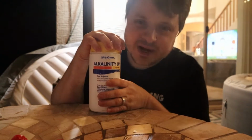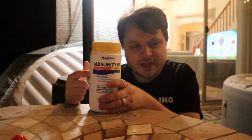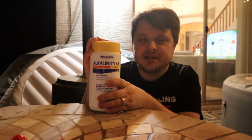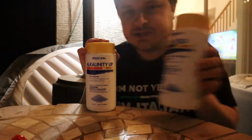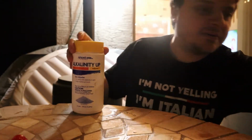pH Up will raise the pH in your water much faster than Alkalinity Up will. So if you need a quick adjustment, you should use some pH Up. pH Up will also raise the alkalinity in your water, although, as I said, not quite as quickly. I don't have any pH Up here, but I do have Alkalinity Up. So you need both of these: pH down, Alkalinity Up, and pH Up. All three of these, rather.